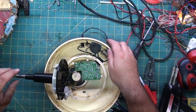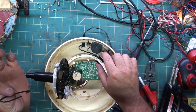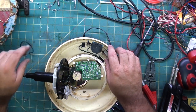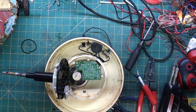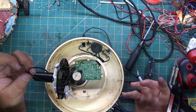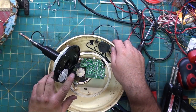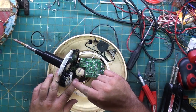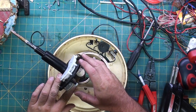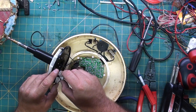Alright. Went through all my belts, or bands. I don't have one that's the same diameter. If it's too tight or it won't turn, too much resistance, too loose, and it slips. Did some research and found that this is the same diameter as an average heavy-ish rubber band. I did go ahead and test it. I got a rubber band on here. And it's turning. You can probably see the gears rotating there. But when I unscrewed this, I noticed that there's a slight issue with the retainer.